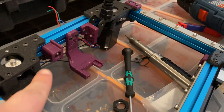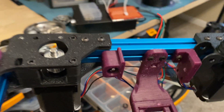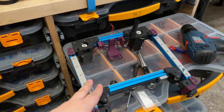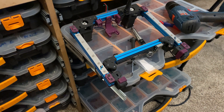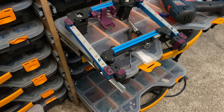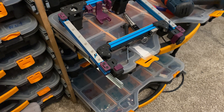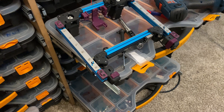On the other side you can see the Z drag chain holder, and inside of it you can see something metal — that's actually a thermistor included with the DFH kit for the hot end, but in this case I'm using it as a chamber thermistor. There is a similar mod for the Voron 2 which was inspiration for the mounting location. I looked at the Voron user's repository but nothing was available that suited the Micron, so I just copied the idea.